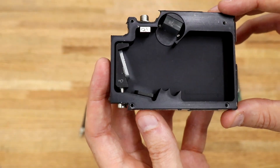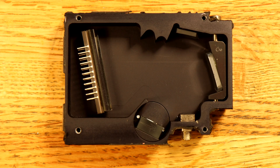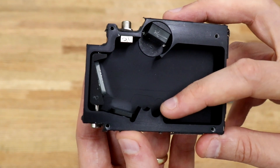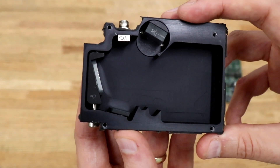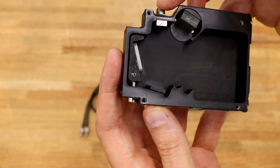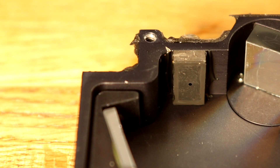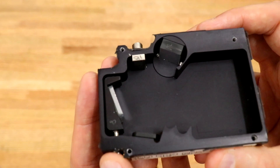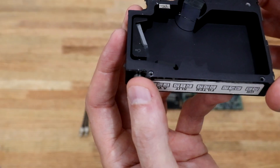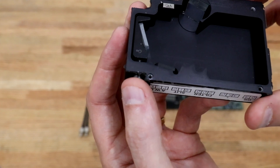This housing is called the optic bench, and it holds all the optic elements rigidly and in correct relation to each other, while allowing for some adjustment. The optic bench may have elements such as light traps and baffles embedded into its body to help guide and trap stray light. The fiber cable is attached to the optic bench by an SMA connector, and light passes from the fiber cable through a slit. Choosing a slit size is a compromise between spectral resolution and throughput of the spectrometer. A spectrometer may also have mode strippers installed after the slit to remove light which has passed down the cladding of the fiber cable.